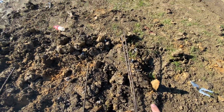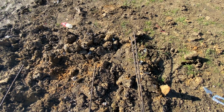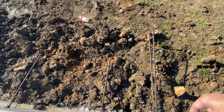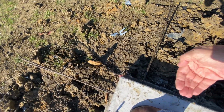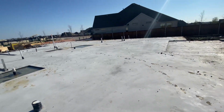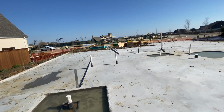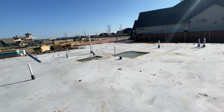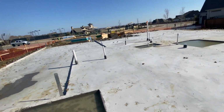And so here's your cables. Can you see these cables sticking out? So these guys are going to have, I think it's 20 or 30,000 PSI, or pounds of force per square inch. When they tighten these cables down, they'll squeeze in this way, and then on the other end that way, and on the other side that way, and it's compressing it from all four sides. What that's going to result in is, if your foundation was to ever shift because of soil shifting, then instead of breaking, it just kind of floats like a raft on the water.